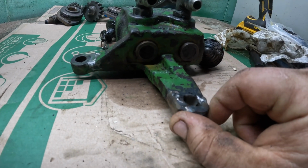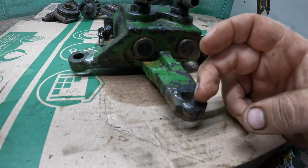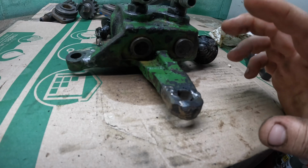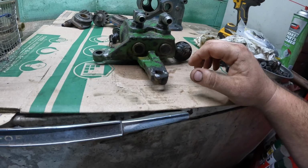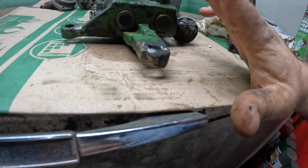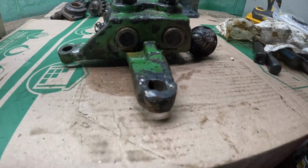So I welded the 2 pieces back together first on both sides, and then ground it down a little on the inside, and then did the other 2 sides. And then when I was done, I had to end up drilling the center hole out so that the bolt would go through it. It ain't pretty, but I didn't have much to work with. And I didn't grind it down too awful much either. I tried to make it kind of smooth, but not take off any more meat than I had to.